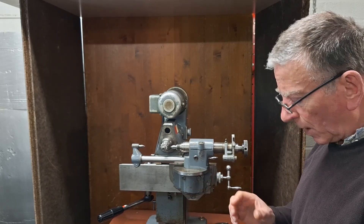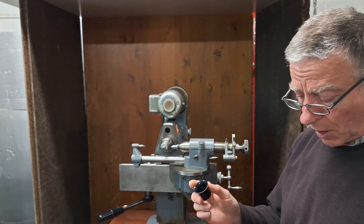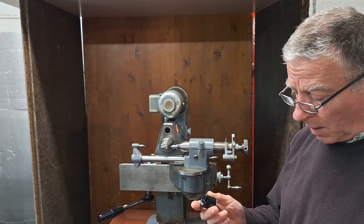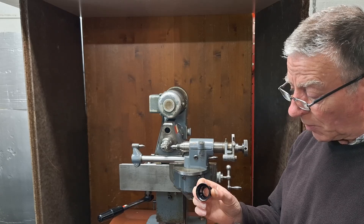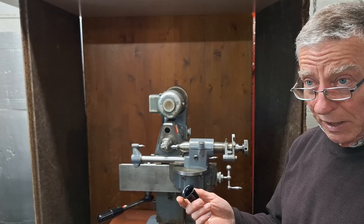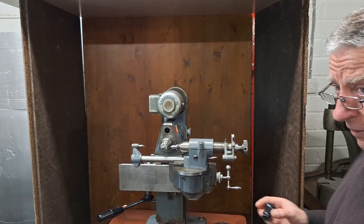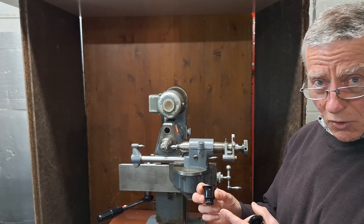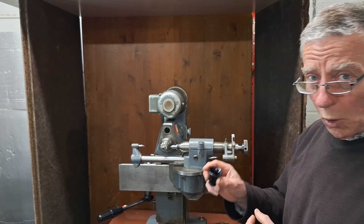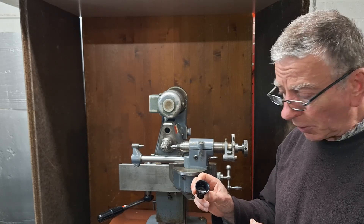The way that you do it is by giving yourself as much advantage as possible by using magnification. An eyeglass — anybody doing this sort of work probably quite quickly amasses a variety of them. Some of mine are marked up in focal length, so a three-inch focal length gives less magnification than a two-inch focal length, but then I have others marked up by magnification. There's a double lens one that gives 12 times magnification, and to be honest that's my favourite tool for this sort of work — the more magnification the better, and 12 times gives pretty accurate results.